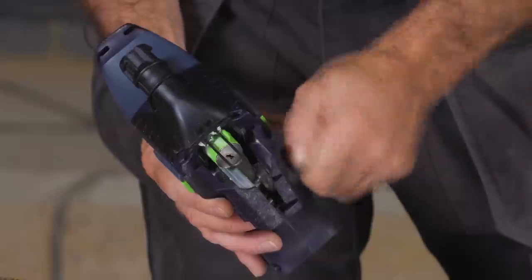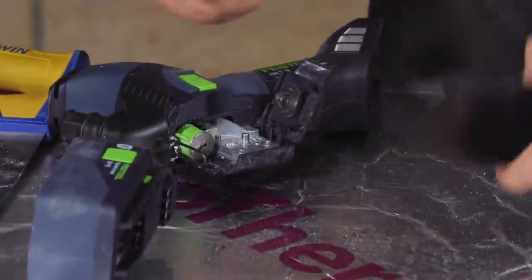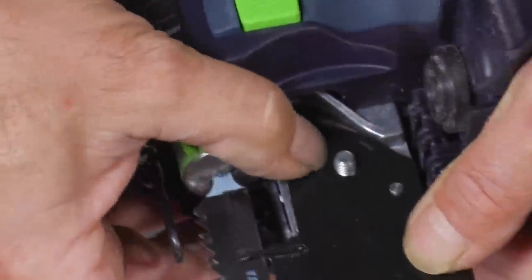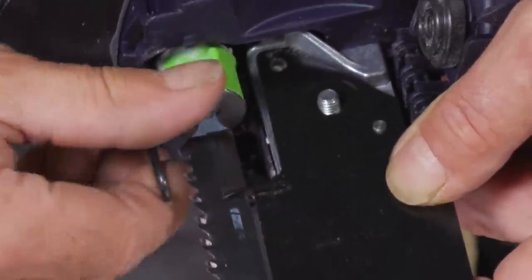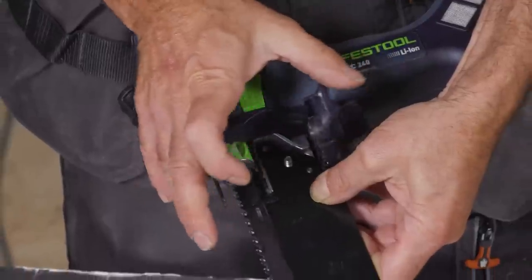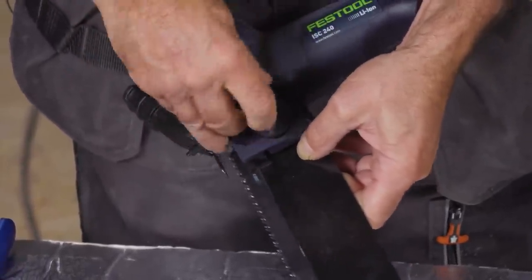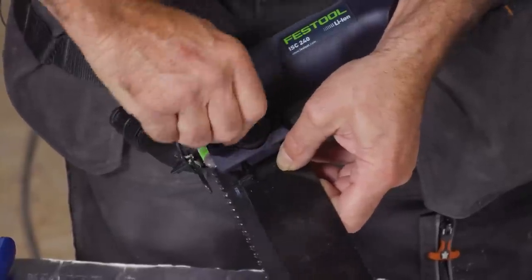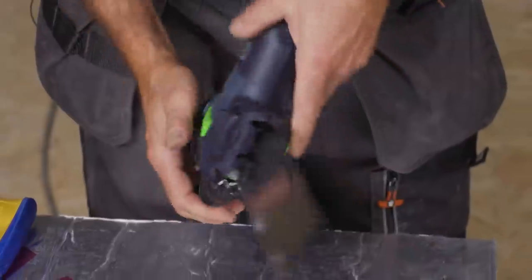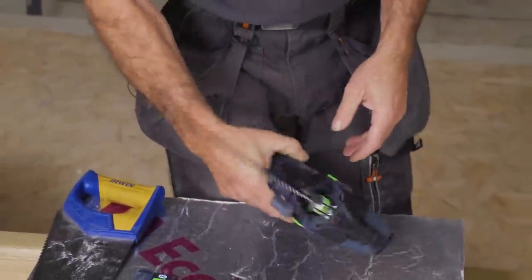I've always got the vacuum out, I'm always clearing up. There's nothing like it on the market. It's just like a jigsaw, and then once you're in you allocate the ferrules and the threaded bolt that comes through, and once you're there you can lock off the blade. That's the blade locked off. Push the door through — the door's got a spring in it — just give it a little push until it bites, then tighten it up. I'd just check that it's all true and square, and that looks pretty good.